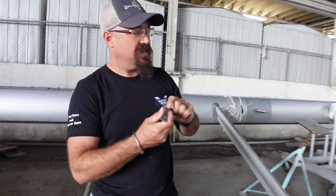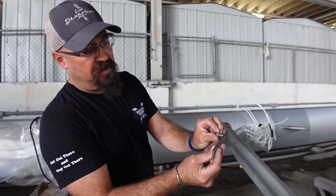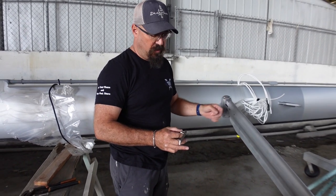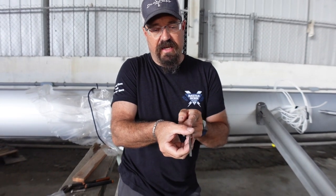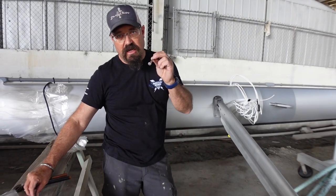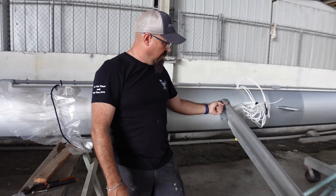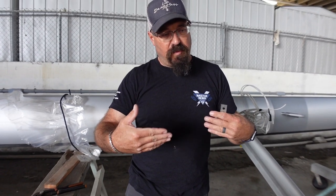There's a T-slot in the side of this boomerang-shaped piece that goes into the mast. This slides in and then there's a bolt with a lock nut that basically holds the T-track aligned with the actual spreader arm. As we slide that all the way in, we'll be able to tighten this down, which will pull the T-slot against the extrusion and hold the actual spreader arm in place. Then we're going to drill through the spreader arm bracket — the bolt will go all the way through with lock nuts on the other side. That's what will keep the spreader arms lined up to the mast. We'll also be able to put the wires in from the sides so the inside diamonds hold the spreader arms in place.